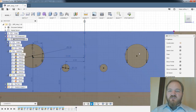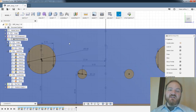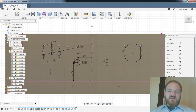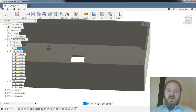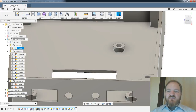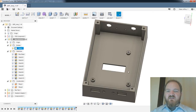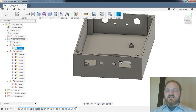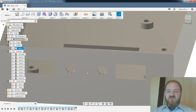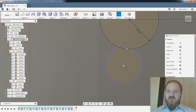What I mostly have found is that the tolerancing, because I'm printing pretty much entirely in PLA these days, with some PETG, and I would love to do this one finally in PETG, just for strength reasons. So you don't have to worry about shrinking at all, but the tolerancing is different based on whether I'm considering an interior hole or an exterior feature or an exterior fit. Dimensionally, I'm not worried about the dimensionality between these posts being wrong, but sometimes it is nice to just hand dimension something like a power pole cutout or a switch cutout, just for the sake of understanding how my printer works and how it does dimensionality. So you're exactly right. But I'm still going to do it my way, I guess.